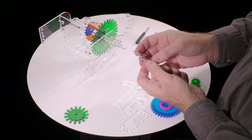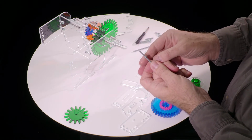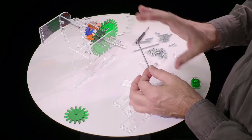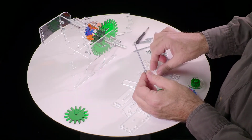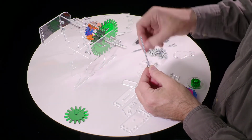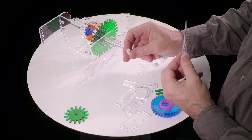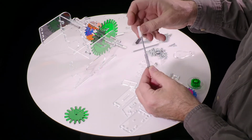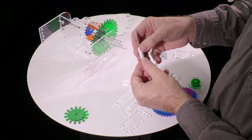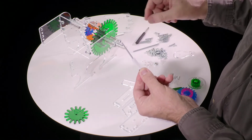And it doesn't have to be perfect, but if you're going to make a mistake in one way or another, have this a little shorter. So maybe just move this nut a little bit in that direction. But there's a fair amount of play available. Okay, and then now we flip it around, and holding this nut so that it doesn't move, put all three of these washers on, like that. And then this piece of square tube slides on, and the square nuts go right through that square plastic. So this now makes a square shaft that is nicely centered on the round shaft.